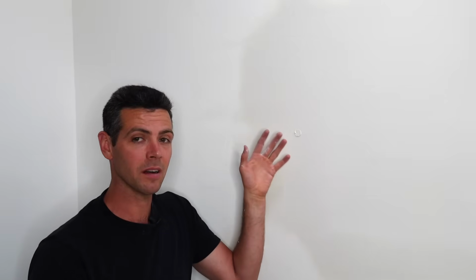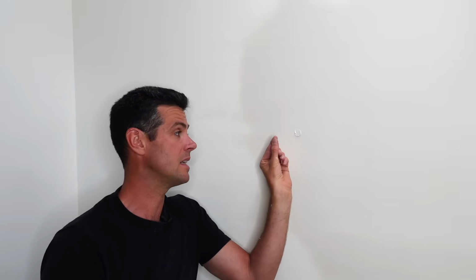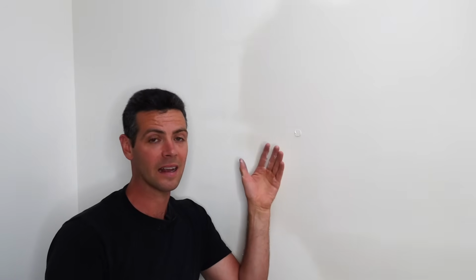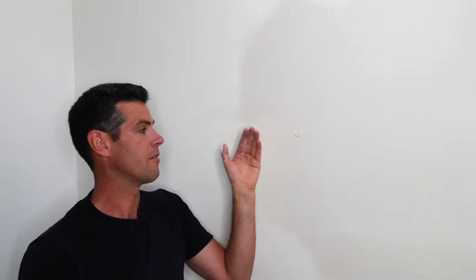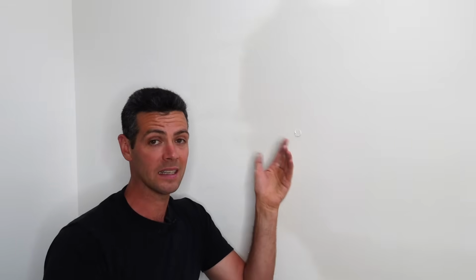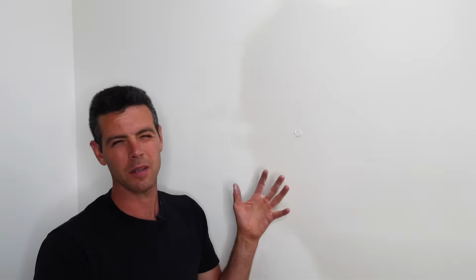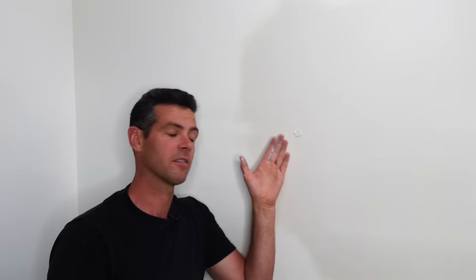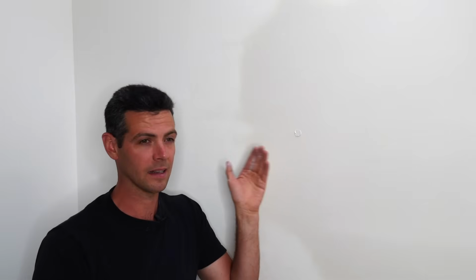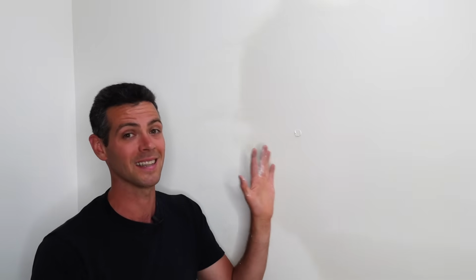I kind of lump it on, not usually this big. The only reason it's that thick is because it needs to be thick so that it can actually shrink. And when I sand it flat, it ends up all flat. Because otherwise, if I wiped it flat on here and I came back and sanded, I would still have an indent when it finished shrinking. So this is to account for shrinkage. But if it was something more just like scratches, I definitely wouldn't have lumped it on like this. I would have wiped it on a little more gently and a little thinner. But again, being careful not to compress the mud.